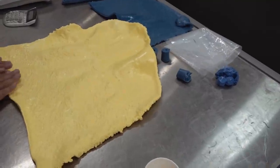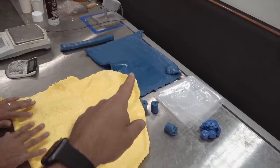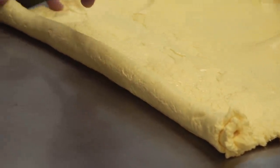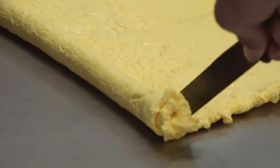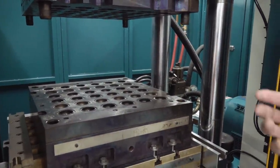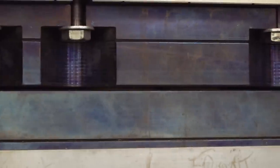We're going to take it over here and roll it up. That's the normal color of a TP5 core. Today, since we're doing a really small batch, we're going to sheet it out and cut preps. And if you look at this mold base, you can see we have many different sizes — again, this is an R&D facility. What's happening is the material forms the sphere, or the core, and then the heat kicks off the reaction with the peroxide, so we're forming and curing the part in this press.